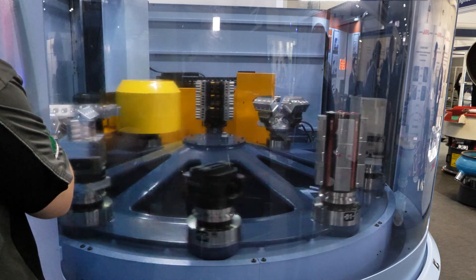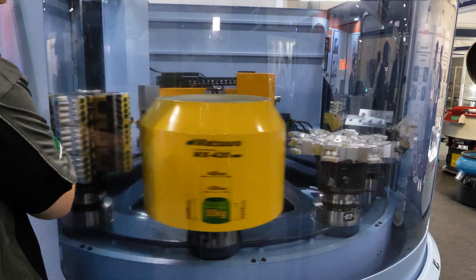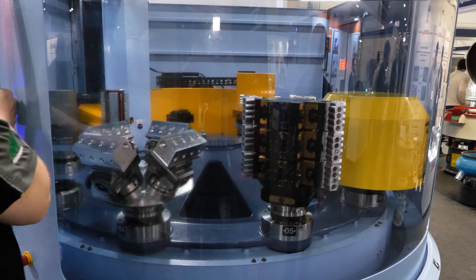Because you can also do 3-axis work, 5-axis work, and tombstone work as well. So how good is that for your customers? It gives a lot of flexibility. Behind us we've got some nice tombstones on show where we can multi-load parts. We can have up to 4 programs per pallet, so you don't even have to do the same job on that tombstone — you can have 4 individual jobs on that tombstone. So the flexibility is as far as we want it to go.